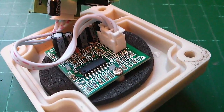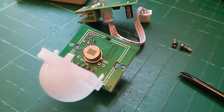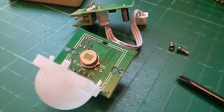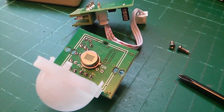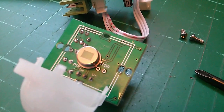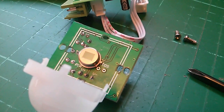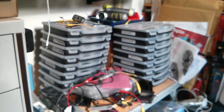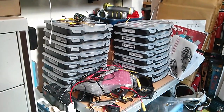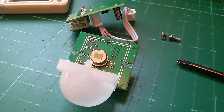It doesn't say CDS on this side, but it might say it on the other — let's have a look. With the dome plastic piece hinged forwards, you can see the PIR — the pyroelectric sensor — which is the metal can thing there. And indeed it does say CDS on those two solder points next to it. So I'm going to try and find my CDS cell, which is in amongst that lot somewhere, and have a good old rummage through and see if I can find it.